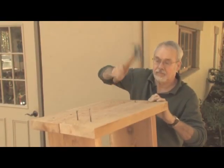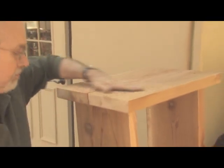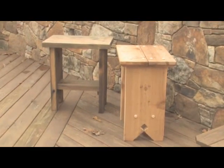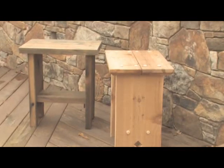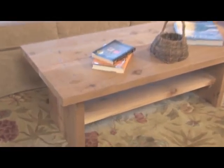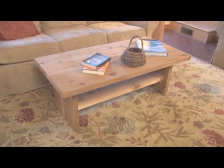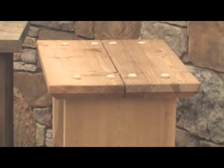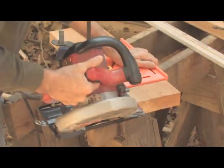I leave a slight space between the two parts of the top. You can mix or match any of these ideas with your own. A coffee table takes a larger top and wider base, so it also requires a support for the top and beefier shelf supports. The sides are made with two 2x8s. I use one-inch-thick stock ripped to one-and-a-half-inch-wide strips for the shelf supports. You can use a circular saw set at a 45-degree angle to undercut the edges of the top, which will make the table top appear lighter.